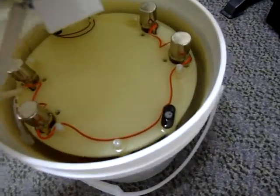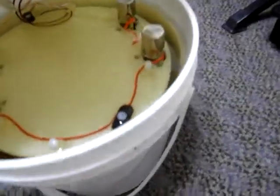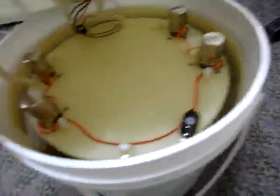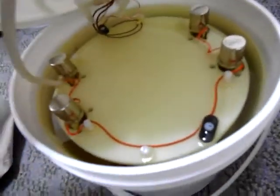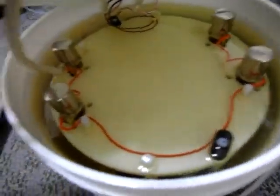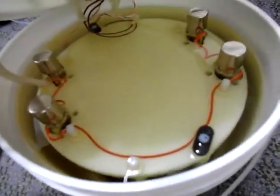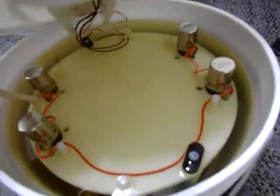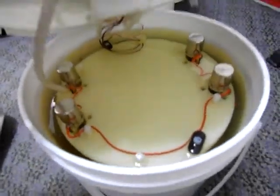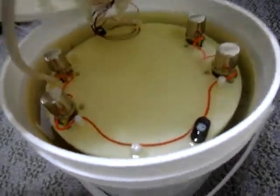The transformer is sandwiched between two HDPE machined holders which also hold the rectifier diode assemblies. There are a total of four diode strings arranged in a full bridge rectifier for the x-ray transformer. The x-ray transformer secondary is center tapped, so each pair of diodes is only conducting half of the time. The diodes are rated to 150 kV peak and 15 mA maximum.